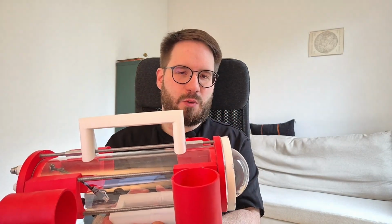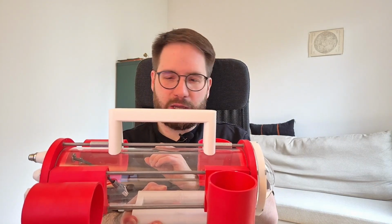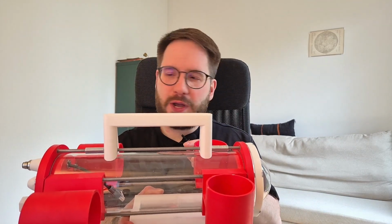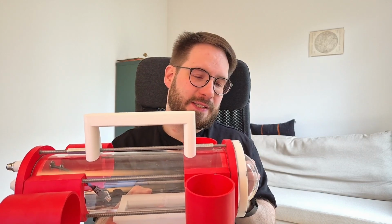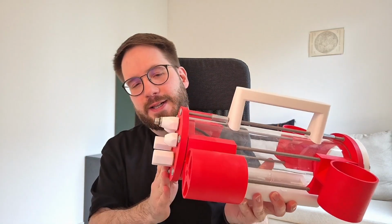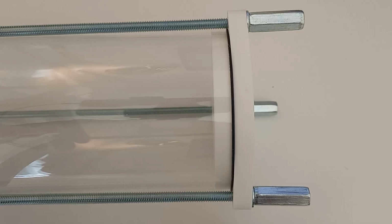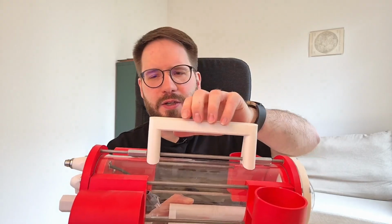The setup is, I would say, quite ordinary. You have an acrylic tube, which is supposed to be the pressure vessel, and water shouldn't get inside it, and you have two end caps. Well, this is not precisely an end cap, I would say it's rather a ring that accommodates the dome, and then I have a rear end cap that has all the connectors. This is all bolted together by these 6 threaded rods. Originally I wanted to use 3 of them, but in one of the previous videos I described that it was very difficult to make this watertight when you use only 3, so I decided to basically double the number of rods, and now I have 6.